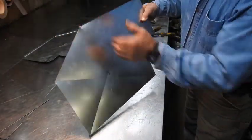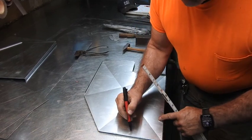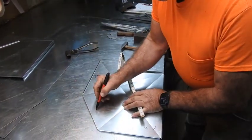Okay, we're ready to fabricate the heel wrapper and the toe wrapper. To get the length of your wrapper, measure all the way from your bend up to where your corner is — that's 9 inch plus 1 for the flange. Measure back from here: 12 and 7 eighths, 8 and a half.